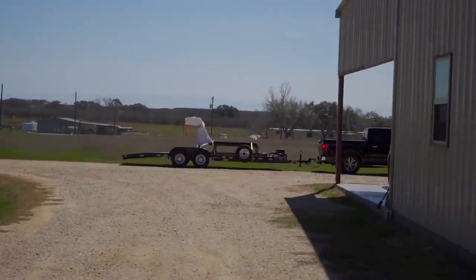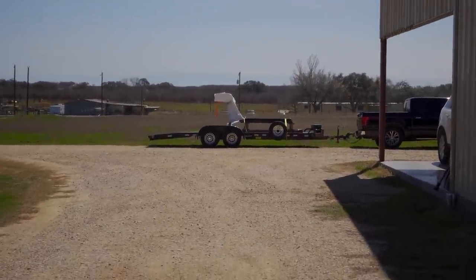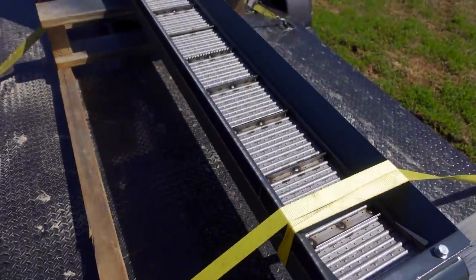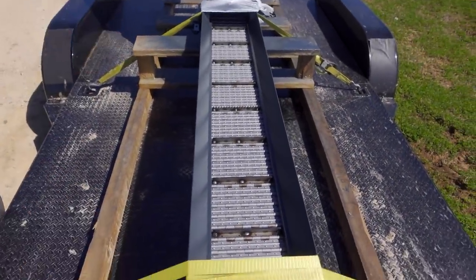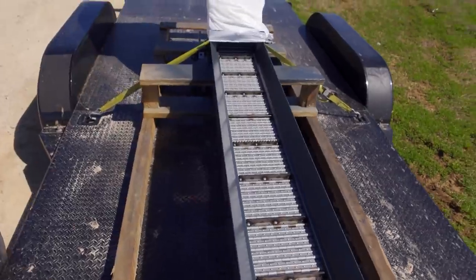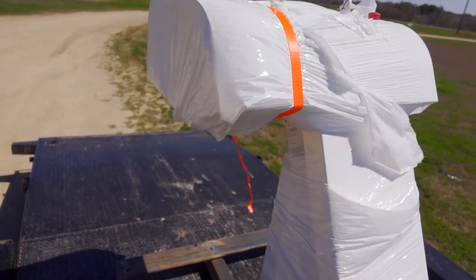There's the first part — that is the conveyor, the chip conveyor. I guess the lathe won't be far behind. So this is the chip conveyor. This goes in the lathe. While the lathe is running, you actually have the option to turn this thing on and off with G-code. The chips would fall in there, it would take them out, and of course you put a barrel under there. That's how you get the chips out of the machine.